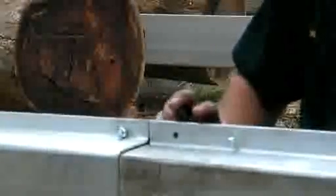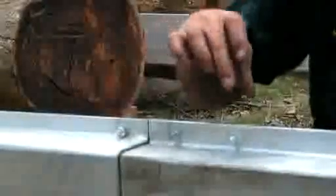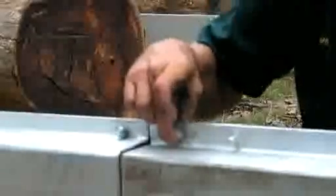You do not need to put a nut on there. If you wish to take this bit of play out of here, all you need to do is slip another bolt in through there and put your nut on the end. You don't need to tighten this — just a nut and bolt through that point there and that will take all the play out of it.